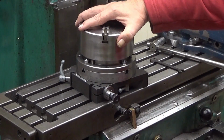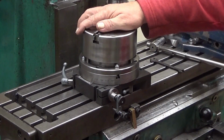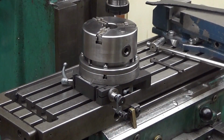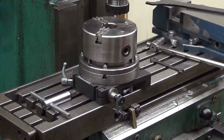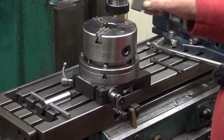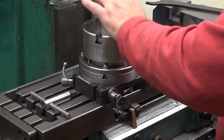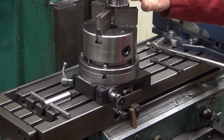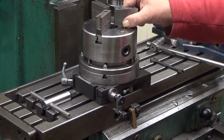Well, it's not completely tightened, but there it is now, and you could dial it in from this rim, actually. It's concentric with the center. Oh yeah, and then you have a chuck mounted on here, and there is of course this chuck key, which can be used to operate the chuck, and then we have a set of jaws. These are soft jaws, and they are not in a very suitable form for operations which I intend to do here. I think I need to, these are soft jaws, so I can actually reform them to suit better for this purpose.